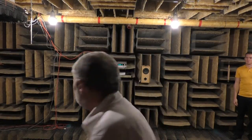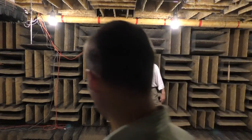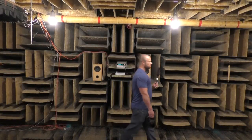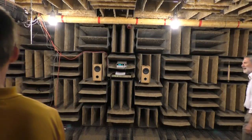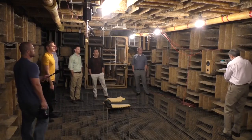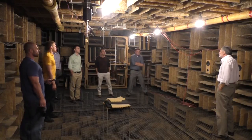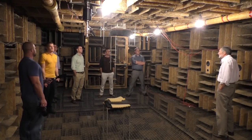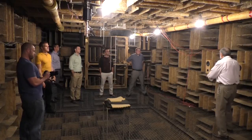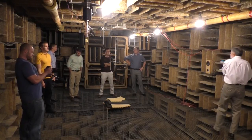So now go here — you'll hear it. That's very dramatic on the symmetry plane, the symmetrical location. You can imagine people sitting around thinking they bought really bad equipment after spending all this money. They would need two speakers and one of them hooked up wrong. That's the most common problem this retailer has with customers — they don't respect the polarity when they hook these things up, you know, black to black and red to red. But it's all relative — there's no magical thing about black or red. Whatever polarity you've chosen for one speaker, you want it to be the same for the other.